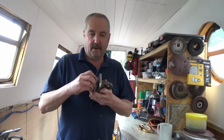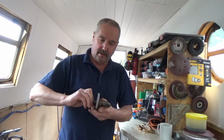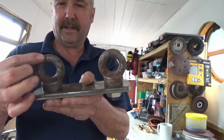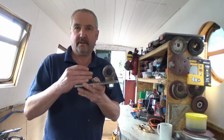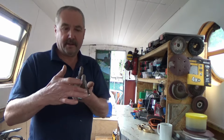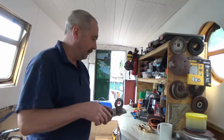I've just got those nuts on for the time being, because I'm going to get these welded on. So it's just a normal eye bolt, a M20 eye bolt. It should be, what are they, 1.6 ton eye bolts, but that's irrelevant. And because I've got all this writing cast into it, I'm going to get the soft pad and clean all that off, so it's just circle and none of that lot. You don't want messing around getting paint in them or what have you. So once I've done that, I'll weld these on around the top. I shall then remove the nut, cut the thread off, and weld around the bottom so they're solid, and that welds to the roof.